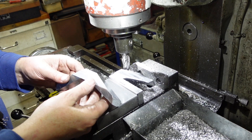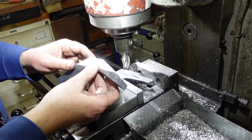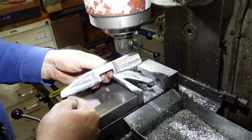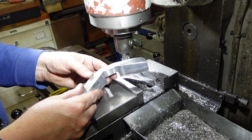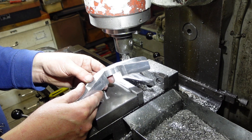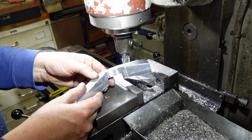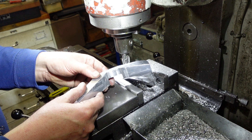There you are — that's the last of the flat surfaces. I've already done this one, so all that has to happen now is I need to curve down there and there, and similarly on this side. I'll need a jig for that and I'll need to do that on the rotary table, but I've run out of daylight today. Thanks for watching and see you for the next one.